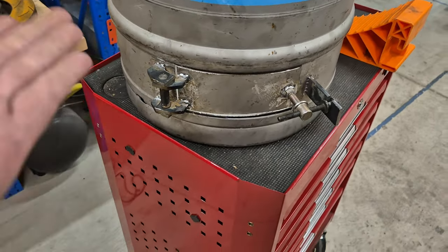So I've got the legs all on now. They're not welded down, so what I need to do now is adjust them all with the grinder to make sure they're all sitting exactly the same. So essentially what I need to do is make sure that they're straight up. That one is currently sitting, so it needs to be straight up. So I'll grind that so they're all straight. And what I need to make sure is they're all the same angle. This one's probably at the most angle.